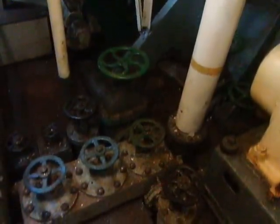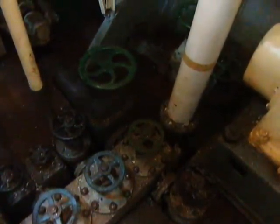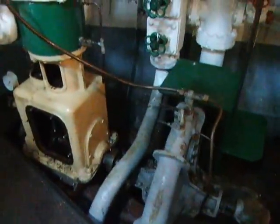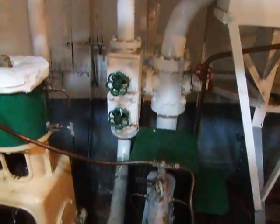On this side we've got shore supply and dynamo and so on. Then we move round to all the valves for various water transfer, fire pumps and so on — all colour coded: blue is fresh water, black is bilge water, and green is sea water. These ones are mainly coming to the fire and salvage pump. This is mainly sea water, and you can see the fire valve — the red one on the right there.